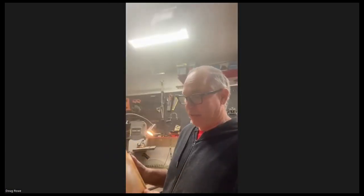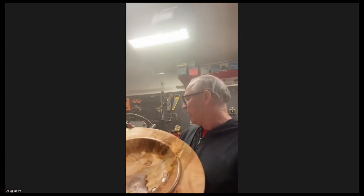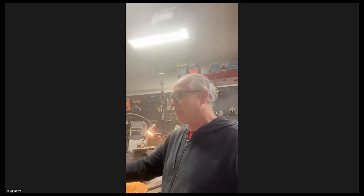Yeah, I've used it quite a few times with really big cracks. The one tip I'd give you if you haven't used baking soda in CA to fill in cracks — do it in very small layers. I found that out the hard way when I was putting the baking soda in, filling it in, and I turned the piece, reverse chucked it, and all of a sudden this white powder is falling out.